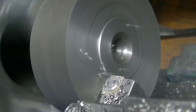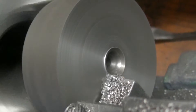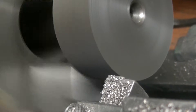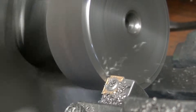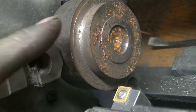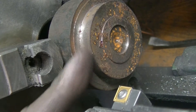I'm just facing it off to get rid of this hole because it doesn't go all the way through. I flipped it over and this side will work way better. We're going to face this off and then turn this shoulder down to a couple thou less than an inch and a quarter.